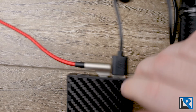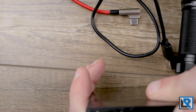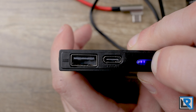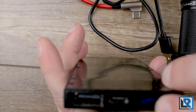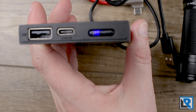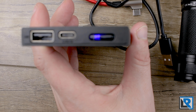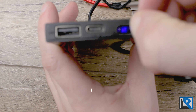The power bank has one other really nice feature: a low power mode for charging IoT devices, headphones, and similar low-draw devices. You press and hold the button and you'll get a white LED at the front of the indicator — again, hard to see on video because those lights are so small. This mode allows you to charge low-power devices without the power bank shutting off automatically. To turn the mode off, just press and hold the button again until the light shuts off.